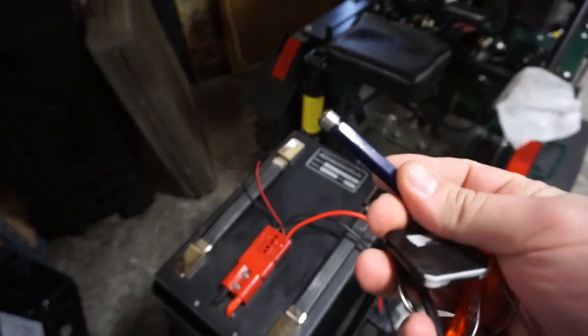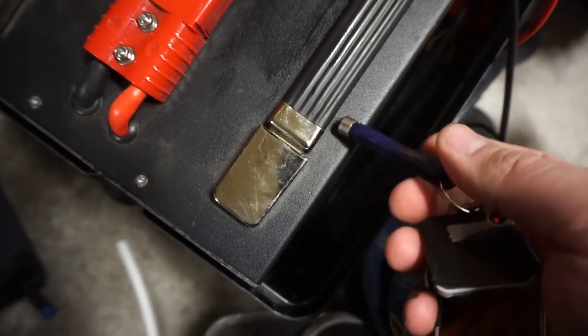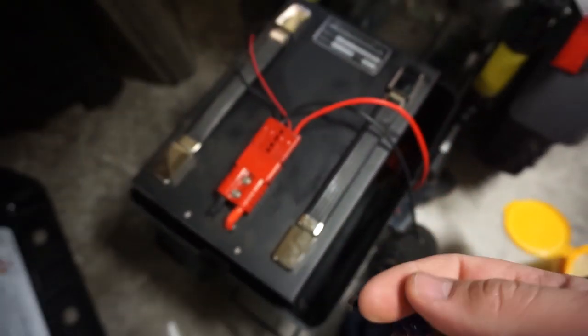A few thoughts on this thing - it does seem to be built fairly substantially. It's in a metal box - I'm going to check if it's aluminum or steel. It's steel. It seems to have pretty good heat dissipation on the battery management controller, lots of big beefy MOSFETs in there. It has two temperature sensors - I would like to see more, but some is better than none. There's Kapton tape on everything, and they've got the fire retardant shields on all sides of the box. I couldn't tell what was on top - I don't think it was a heater, but it would be kind of cool if it did have a heater for really cold temperatures. It's actually better to use a little bit of electricity from the battery to keep the pack warm - you can take a note from Tesla on that.